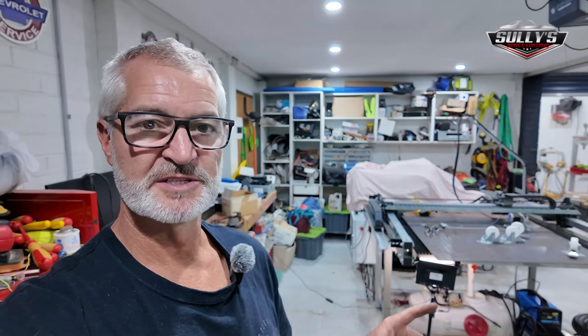Welcome back everyone to Sully's Rods and Customs. Just a quick video today — I'm going to show everyone what I've done with my plasma cutter. You can see underneath it there I've got a tank, and on that tank I've got a little pump. I'm able to drain that water pan back to that tank, and when I need to I just pump it back up. It takes all the swarf off through a strainer at the bottom so it doesn't stay in your pan. It's cheap and it works.